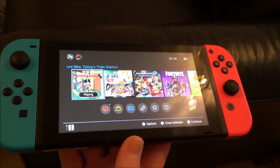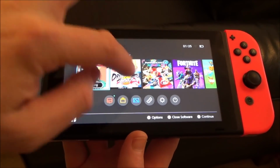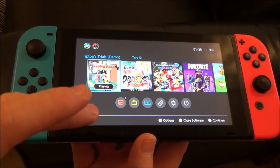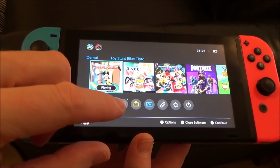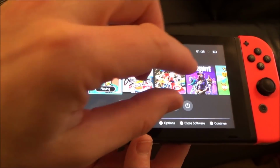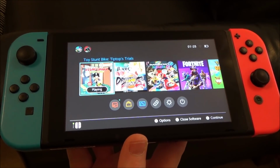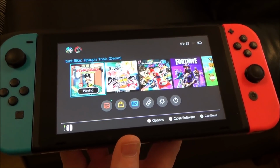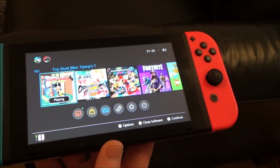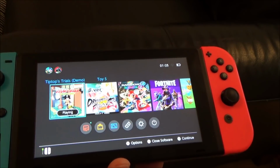But for this particular one, I was so happy because you've seen that originally it was shorting all around that tiny little chip. Changed it out, those shorts went. There was a short by the power IC, the charging chip, and then I thought that was linked to the video chip, which it was. There were also shorts by the video chip and further up on the board. Changed the video chip out and those went. And that also got rid of the short by the charging IC, the big chip. Then I took that one off and it looked like it had corrosion. It looked faded underneath. And when I changed that out, that was the very first time it started to charge at 0.4 amps. That's because I was using a battery that was already, I think, full. Remember, it was testing 4 volts while this was testing 3.7 volts.